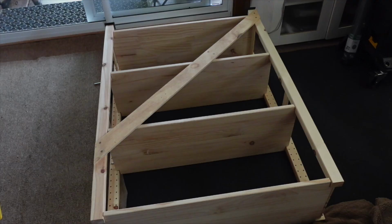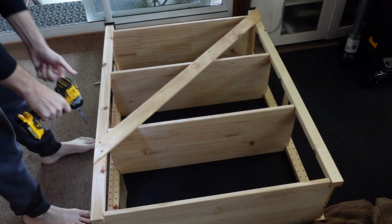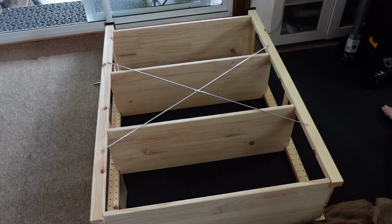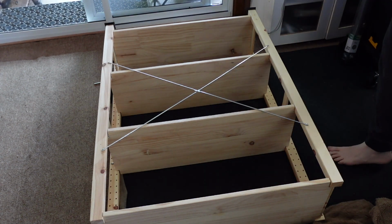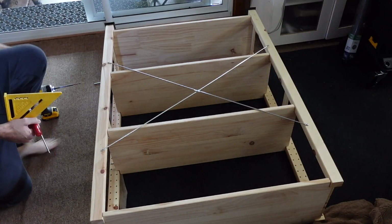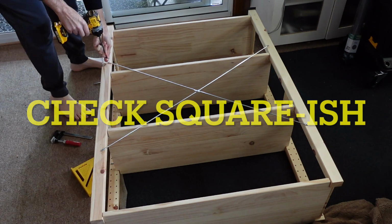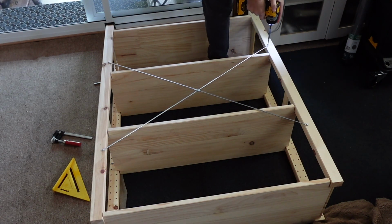With the shelves already cleaned off and laid down, I took the screws out of the temporary plywood brace that I put on the back. I roughly lined up the brace first, securing it in place with one screw. Then I used my speed square to check for square-ish. Then I secured the other 3 screws. I could call that job done like a dinner. Done like a really cheap dinner made by someone who doesn't wash their hands probably.